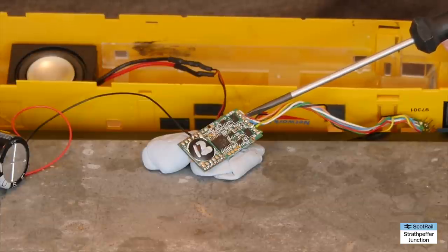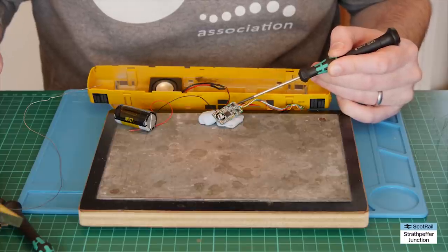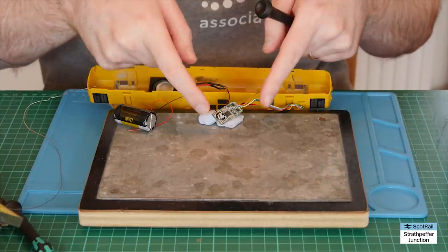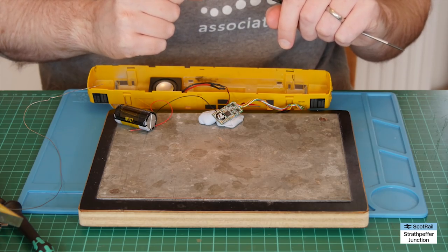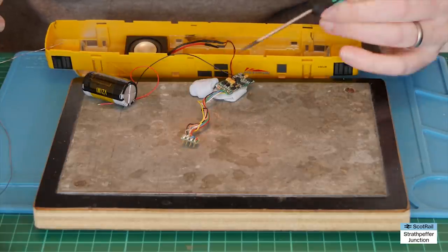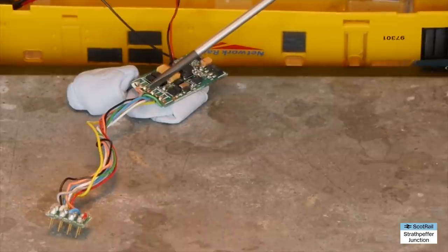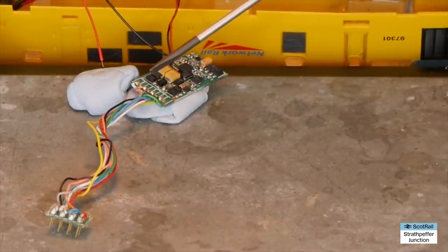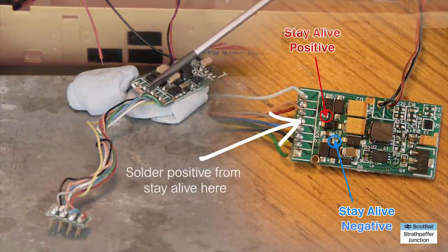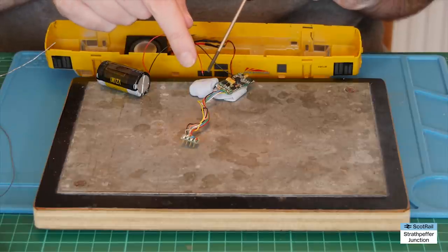We could use the blue wire tab here for the common positive, but because there's an identical tab on the reverse I'll probably use that — I have a feeling that if I try to solder another wire onto this side it'll make the blue one pop off. So I'll reverse the chip and double check which pad we're going to solder onto on the reverse. We want to take the common pad and attach the red wire to it. The common pad is this one here — I'll pop the diagram back up on screen. There shouldn't be anything on this side already soldered to this pad, so I'll pop a little bit of flux on there and flow a little bit of fresh solder onto the top.